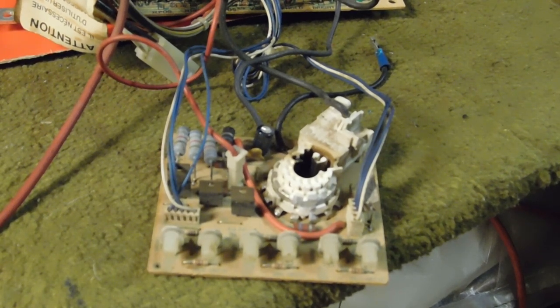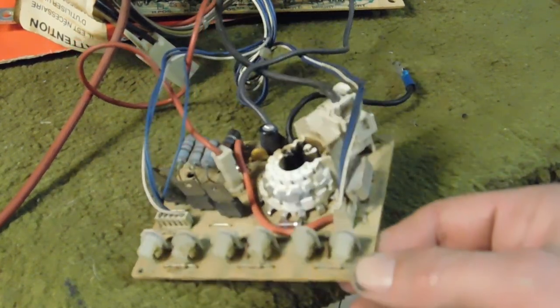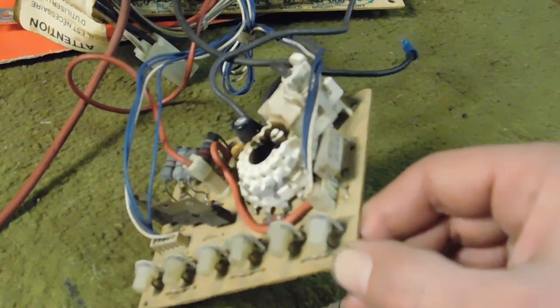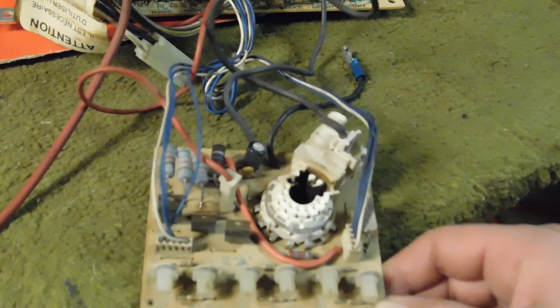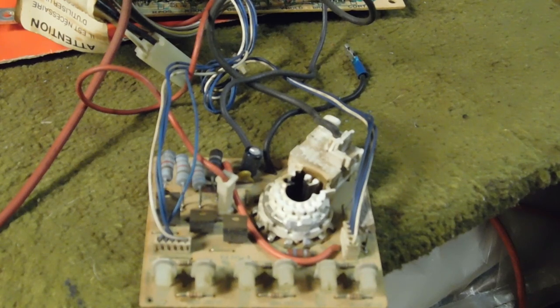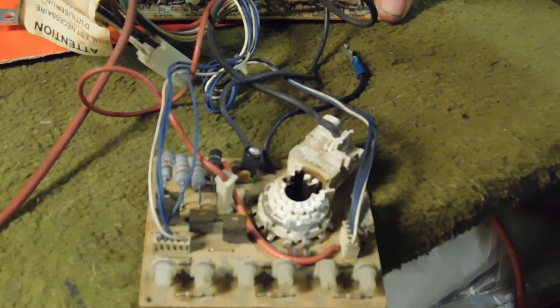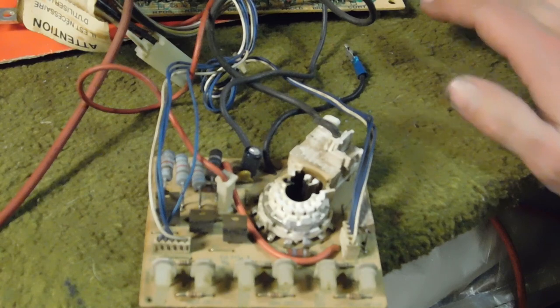We're going to be doing a little bit of work on a Wells Gardner K7000 chassis board. The first thing we're going to be doing — there is a lot we have to actually do to this board unfortunately — but as you can see, this neck board socket is pretty much toast. Look at that charring on there, that's horrible. I cannot allow myself to reuse this socket. We have a lot more that we have to do to the actual chassis board itself, so there's going to be more videos about it.